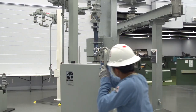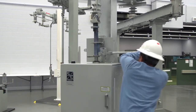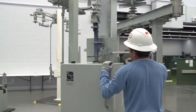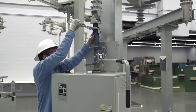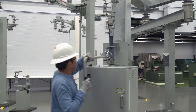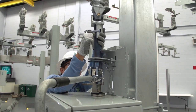Check the handle operation position by swinging the pipe handle 90 degrees clockwise and 90 degrees counterclockwise to open and close the switch. If the decoupling mechanism hits either side of the back plate, the universal joint must be readjusted so the 90-degree swing centers on the front side of the switch operator. Now tighten the piercing bolt on the universal joint into the decoupling pipe.